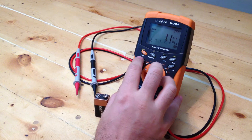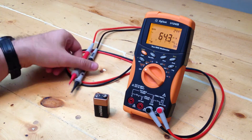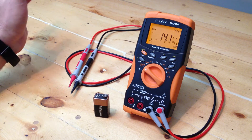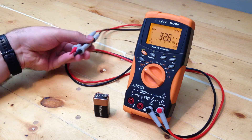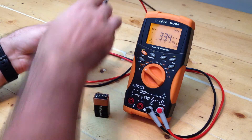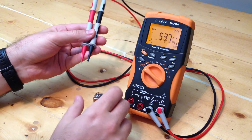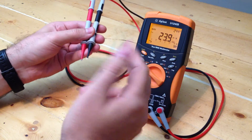Let's go to AC volts now. Turn that backlight on so you can see better. It floats quite high, around 14 to 15 millivolts, but when there's a DC voltage present, it jumps up and takes a long time to settle back down. And when it auto ranges to the thousand millivolt range, as soon as the range switches over, it jumps back up into the 10 volt range.